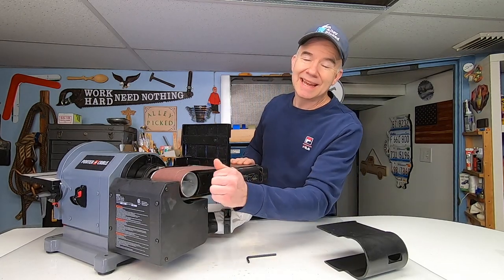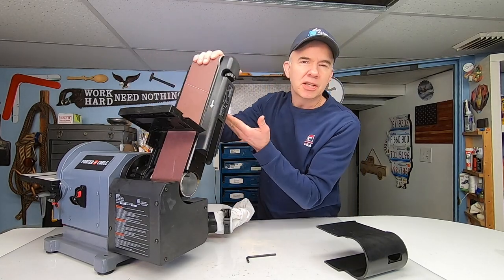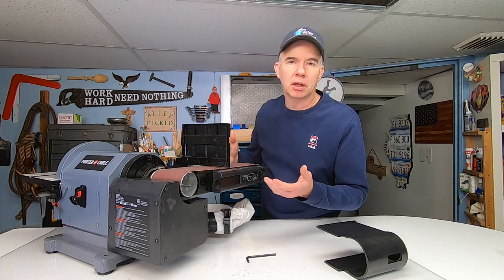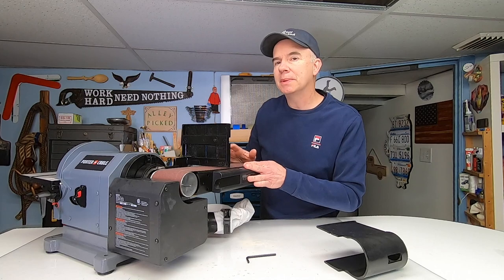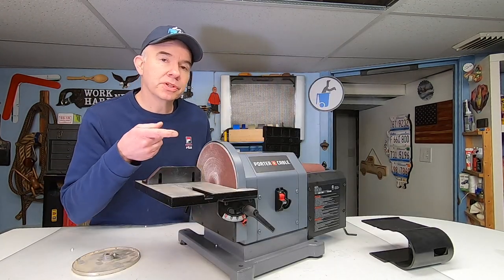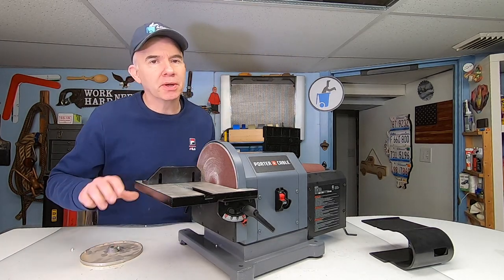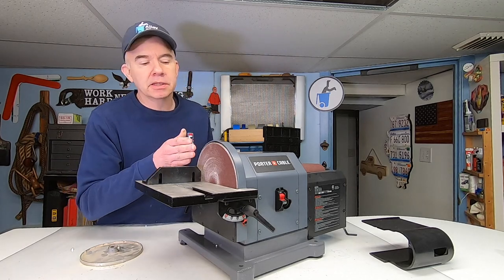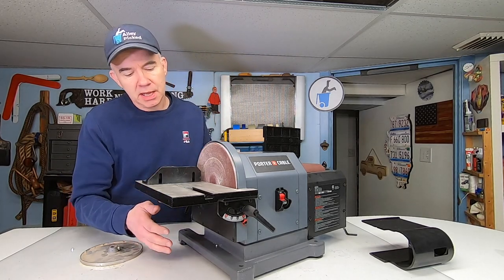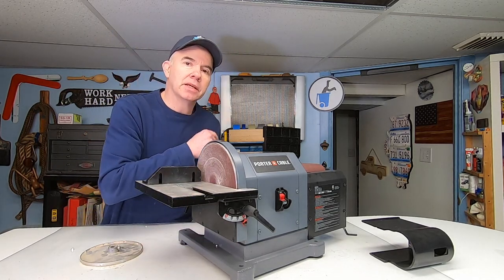This thing can sand both horizontally and vertically. I've seen other sanders that have a support leg that you put under here — that's just a little more clunky and it gets in the way. You don't need it with this one, maybe because this thing weighs 41 pounds. Number two, the circular disc is 8 inches. My previous one was only 6, so you have a much bigger surface area for sanding. It does use peel-and-stick paper which is not extremely easy to remove — you've got to take off this plate and this fence and then peel it off.